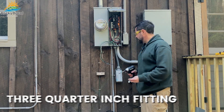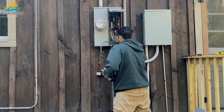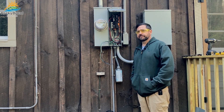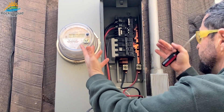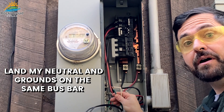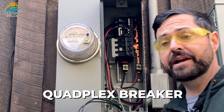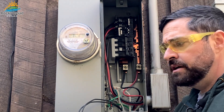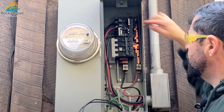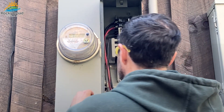Now I'm going to throw a three-quarter inch fitting on here, just a one-hole strap to get the pressure off of that fitting up top. I did already kind of strip that fitting out, but we're just going to go with it — it's still weathertight. Now I've got my wire stripped. This is my main service panel, so I do have my neutral-to-ground bond in here. Therefore, I'm going to land my neutral and grounds on the same bus bar. Then I'm going to land the two hots in what's called a quadplex breaker. I ran out of room on this bus bar — you can buy breakers called quadplex or tandem breakers to make more room. Essentially, I got two double-pole breakers in this quadplex breaker out of one spot for a double pole. Those are super helpful when you run into situations where you don't have enough breaker space.